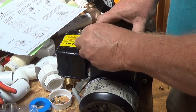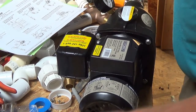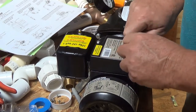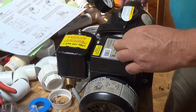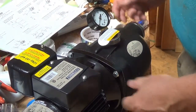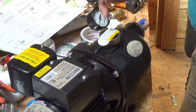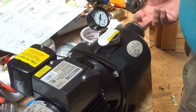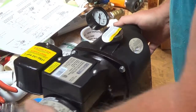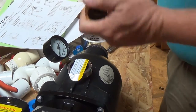Now, while we're at it, there are all kinds of plumbing fixtures. This is a pressure switch — it's a 30-50 pressure switch. This particular pump has a pressure gauge already on it. This is the in, this is the out. This is one and one-quarter inch in, and this is one inch out. Why it's that way I don't know, it just is. This goes on the pressure tank.